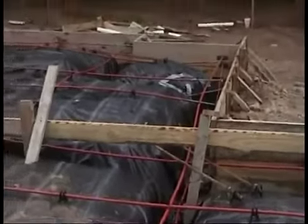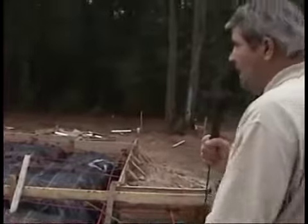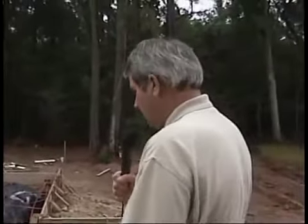Now we have to look at the bottom tendons from side to side. Same procedure with the bottom tendons from side to side. 1, 2, 3, 4. I'm counting the number in the field, bottom tendons side to side that I have in place. Then once again, I've got to compare that to the number required in the plans. As with the top tendons, if they're not correct, we need to notify our clients so they can get a hold of the supervisor and say this is not following the architect or engineer's specifications for the site.